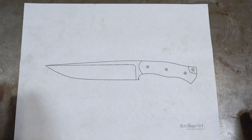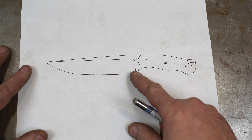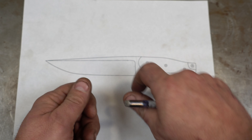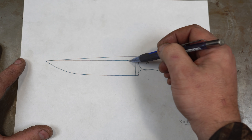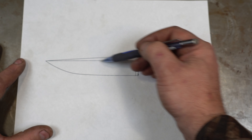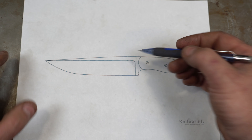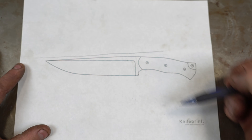Let's talk about bevels and how to get different shapes on your bevels. If you sit the knife down on the rest and run it straight across the platen — remember, pulling with one hand and pushing with the other — with totally even pressure you will get a straight line. Assuming you have perfect pressure it should be straight across, matching wherever your rest is set.